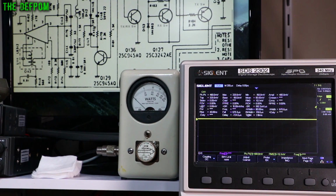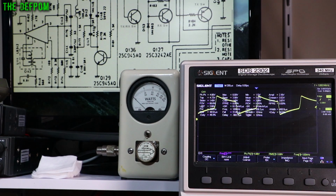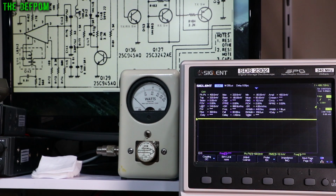I don't have the circuit layout with me. Only some components are labelled on the board. The resistors aren't labelled. Capacitors aren't labelled. The only things that are labelled are inductors, diodes, transistors, and the VRs. Resistors and capacitors aren't marked on the board, so it makes it hard to deal with. So yes, definitely a modulation and a voltage offset on transmit with audio on AM. So that's what we're supposed to be getting there, I think. So I can't fault that bit either.